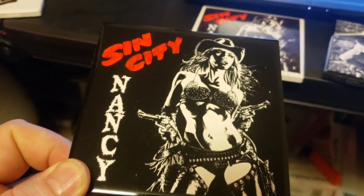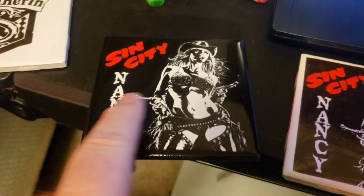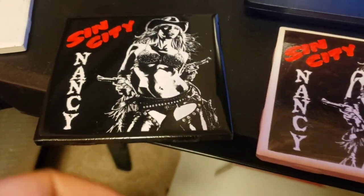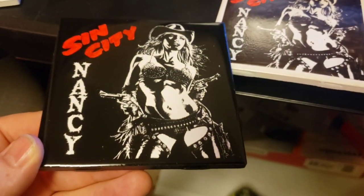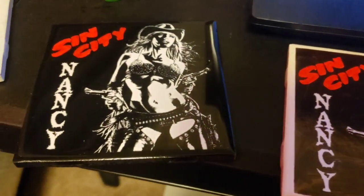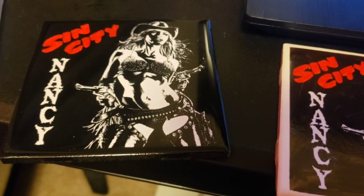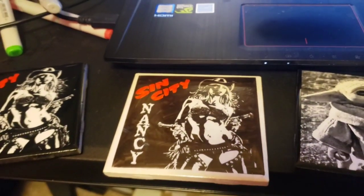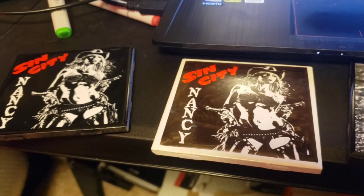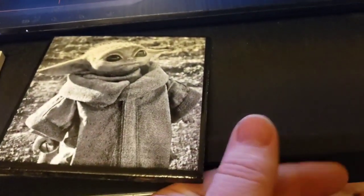I didn't clean off the tile — I just sprayed on two quick coats of matte black spray paint, one left to right and one vertically, making sure everything was evenly covered while keeping it thin enough to maximize my speed and power settings. I try not to run at slower speeds on my channel. I'm seeing what maximum speed I can run at, and typically 85% power is as high as I run my laser. I don't buy into running diodes at 100% — it seems like everyone running at 100% sooner or later has their diodes start dying and losing power quicker. I don't think any laser should run at 100% for extended periods.